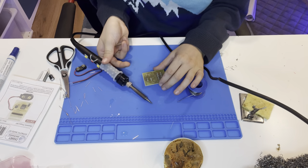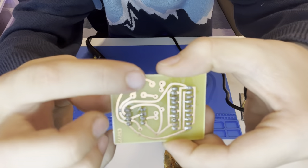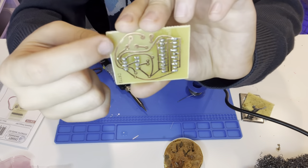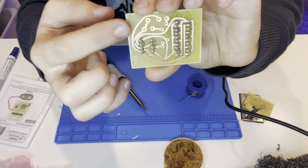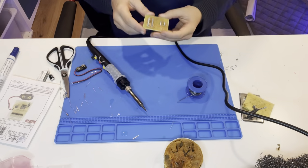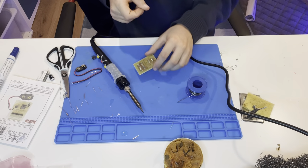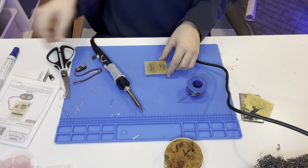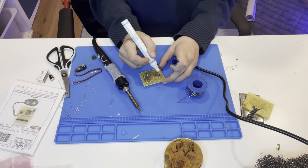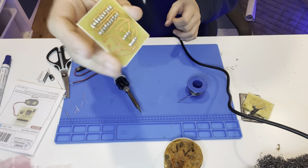On these little trace-shaped marks on the board, if you get any solder on them it doesn't matter as long as it isn't touching anything else. But if it touches a different trace, use your solder wick to push it off. If the flux pen runs dry you can push it in there to refresh it — and now it looks clean.